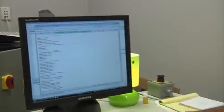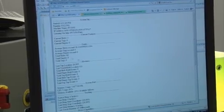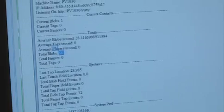Okay, so now that we've run the test, we want to see the test data and see what shows up. What I have on the screen here, remember the application over there has an HTTP server on it, so I can browse to it. And I can see the test data that comes back. I can see that I've got 68 blobs that have gone down in this test run. And I can see stuff like their locations, how many I've put down per second.